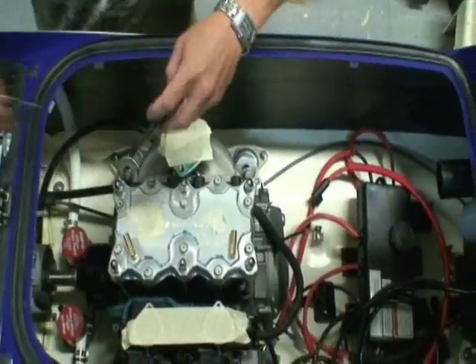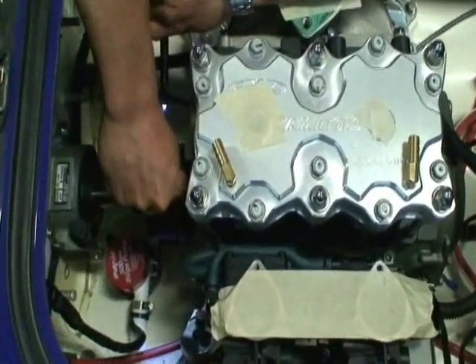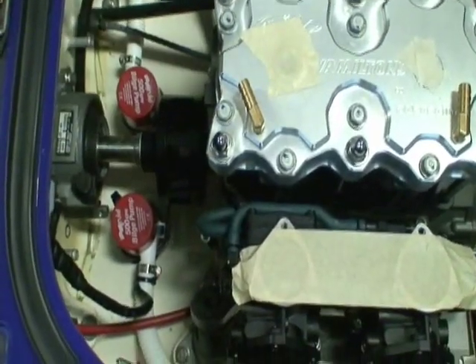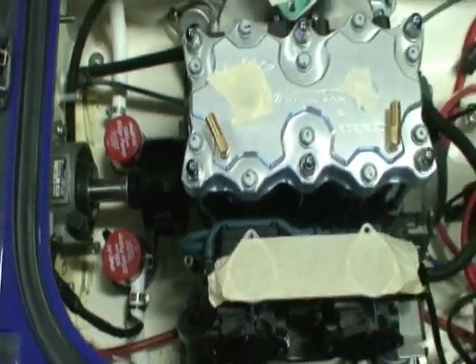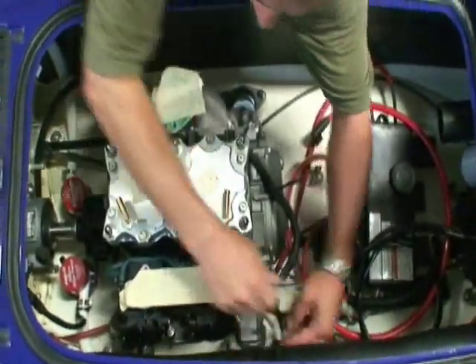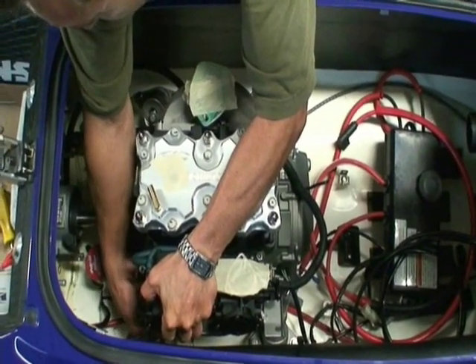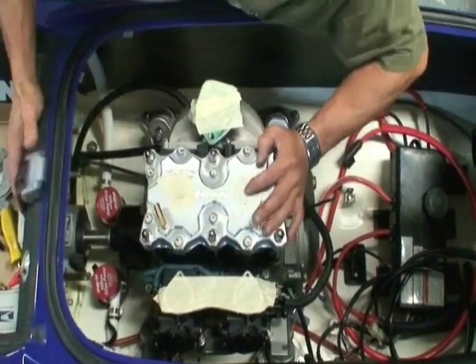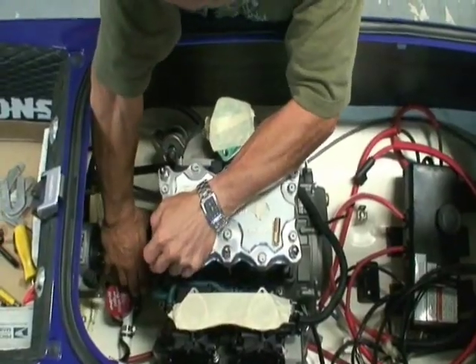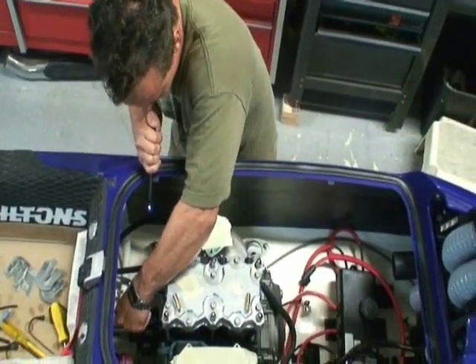Let's do it the budget way. We've got another millimeter to go, so we go ahead with two millimeter shims — two on this side also. That's what it usually comes on the ski: two millimeter on each motor mount, one millimeter on each motor mount. Slide it back again, just check it. The shim — boom — right on the money. There's no gap between.